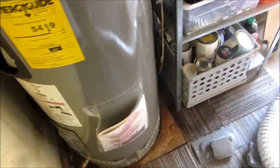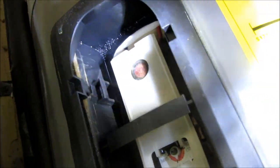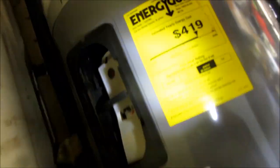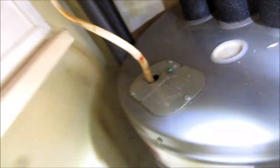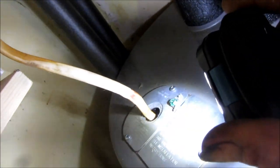We can turn it down. This controller — there are two controllers basically. You can see we got water up in there. This controller will heat the top of the water heater first, and then when that's up to temperature, the bottom one kicks in. This is a 220-volt water heater and should have a collar on that connection right there.